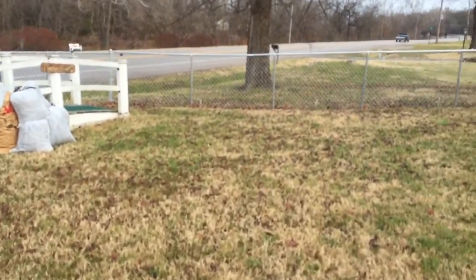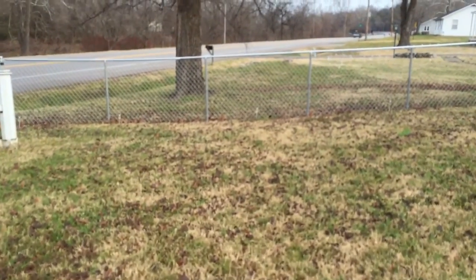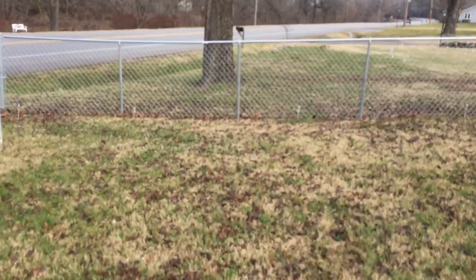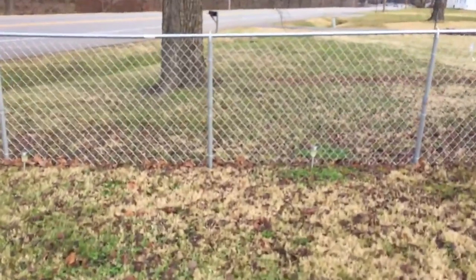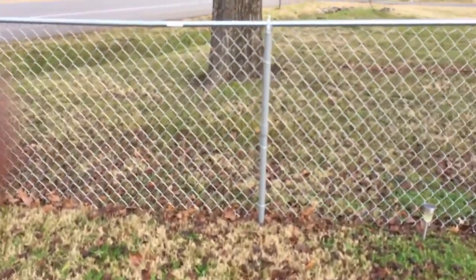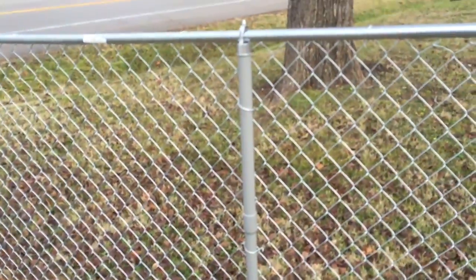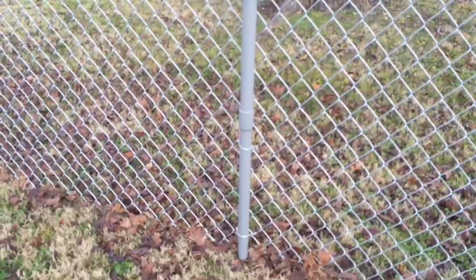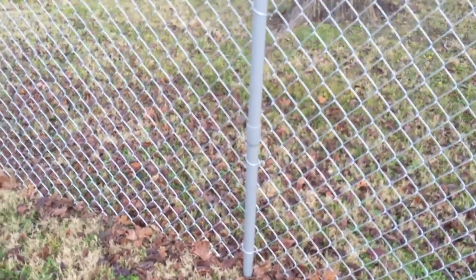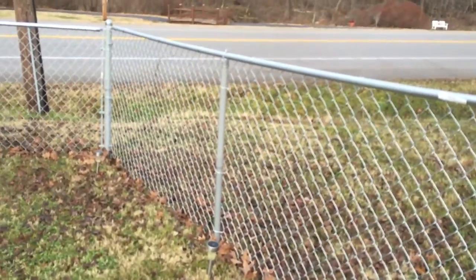There's nothing wrong with using plastic pipe instead of metal. The significant savings on this small fence is almost four hundred dollars. You can see here where I use the swedge — the swedge was four foot long, and then I used two-foot pieces I cut. Just drove them into the swedge, so that's two foot in the barrel, and that's holding it just fine.